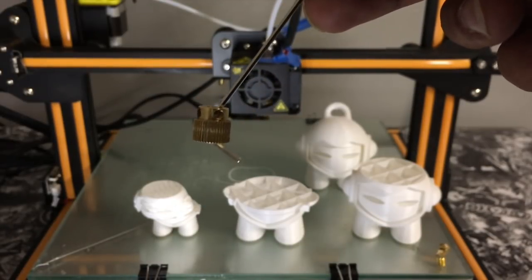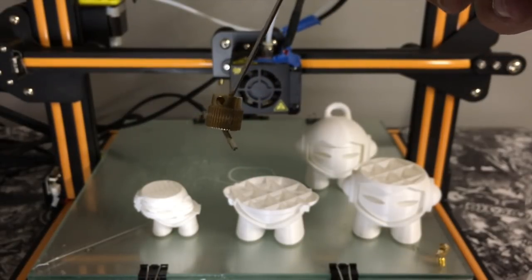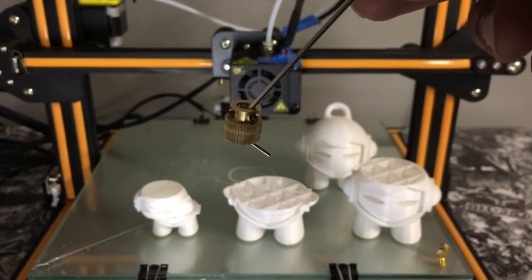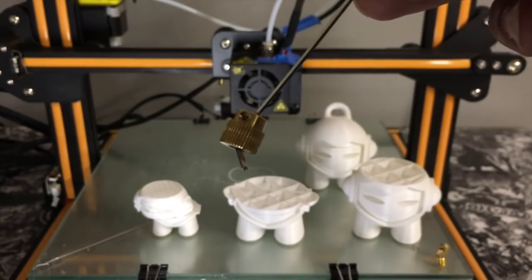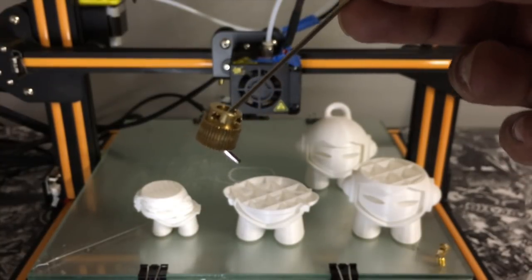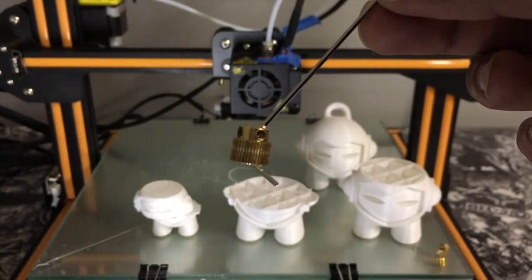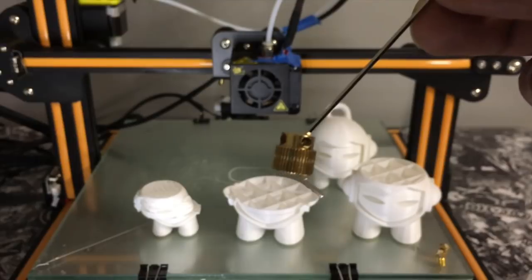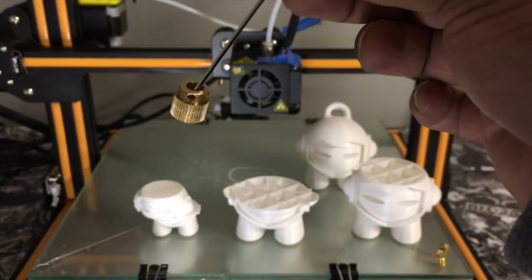that is caused by a clog in your nozzle, because once your nozzle is clogged, this thing's constantly trying to turn and feed the filament through, but if the filament's not going, it's constantly just rubbing and rubbing and rubbing, and over a period of time, it does that. And I have had this printer for about 7.5-8 months, and this is the first time I've noticed this. So I was going crazy trying to figure out why, changing out nozzles and everything, why my clog was still there. But eventually I came back and saw that my printer was actually printing and no filament was coming out, so I just assumed it was a clog. But when I took a closer look, it was actually this gear or pulley that got stripped.